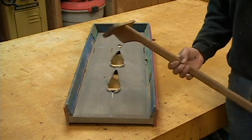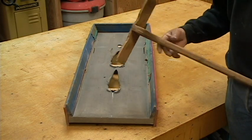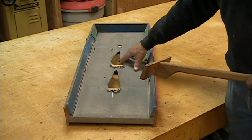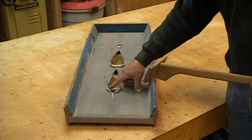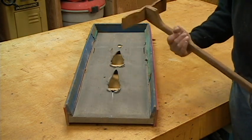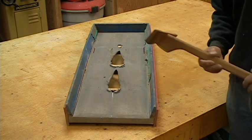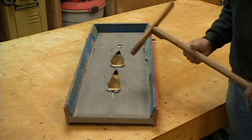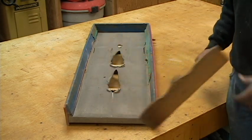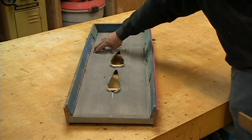It's made out of poplar. At the beginning everything worked pretty good, but as it wore down, it wore down uneven. As it was coming across here, it would start wearing on this poplar as well, so it got some dips, it got some bows in it. I would take a cut off when it was much longer, bring it back, square it up, run for a while, but inevitably it would get out of whack and start to not run true through here, creating some dips and valleys, some lines.